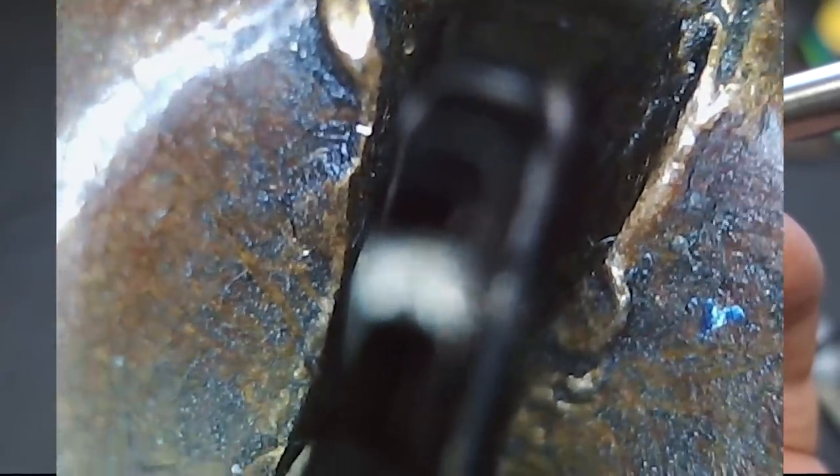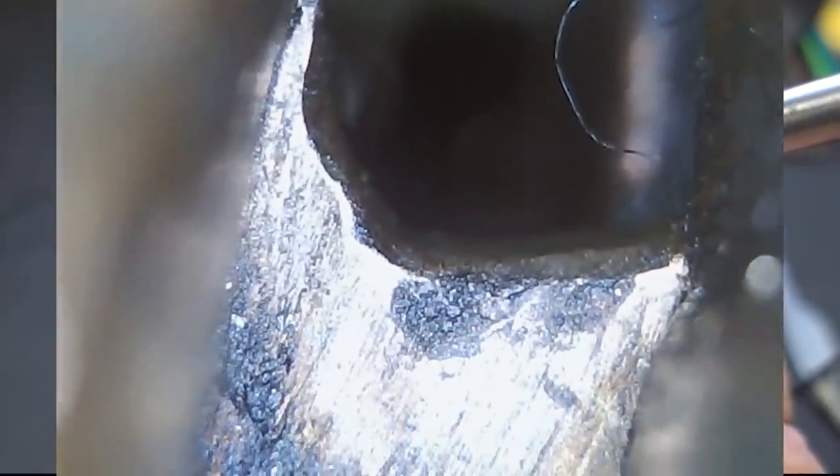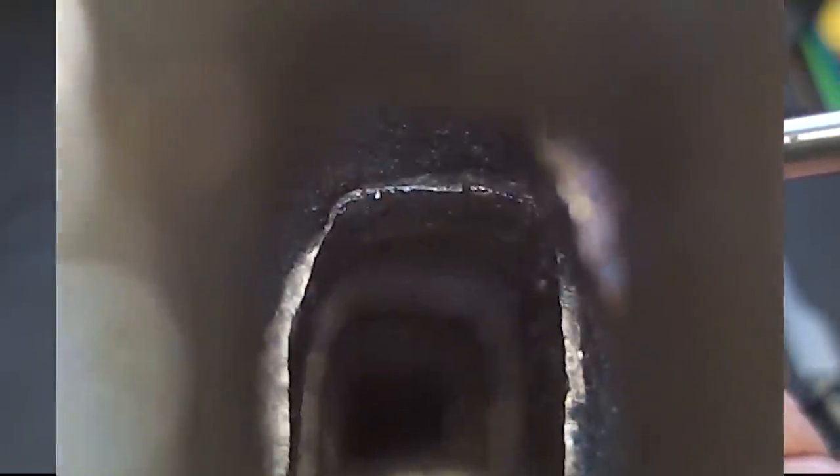This lock has had some hard days, but I really want to look inside. You can see a wafer hanging down right there at the entrance. A lot of wear on that guy, a lot of unevenness — right in the center. I don't know if that's from picking or what. It's growing hair, so we may have to shave our way in there. A lot of corrosion all up and down the keyway. There's another wafer hanging down right there, and I think I see one right near the entrance — just barely hanging in the way. I only see two, perhaps three wafers to deal with here. I would have expected at least four, perhaps as many as five, based on that key. So other than learning that we needed to shave the inside of the lock, I'm not sure we learned a lot.